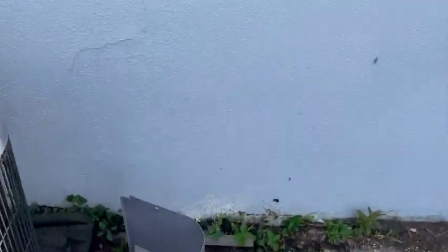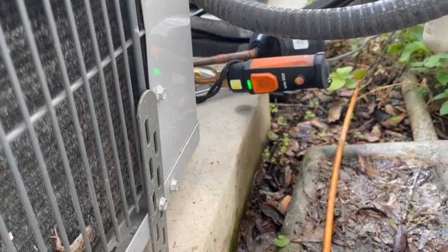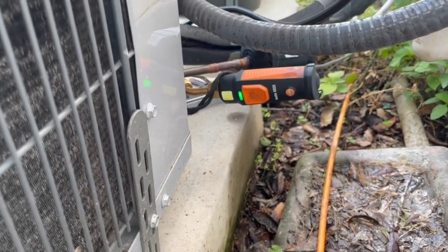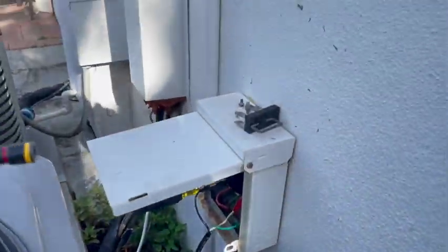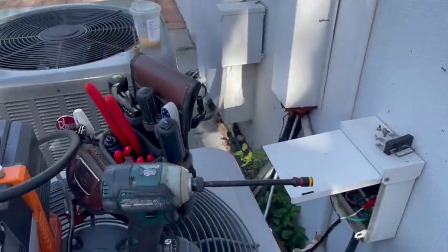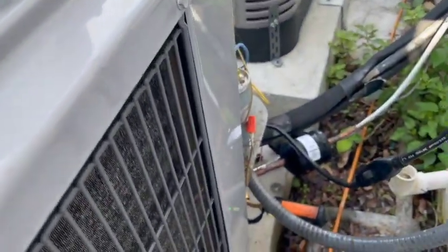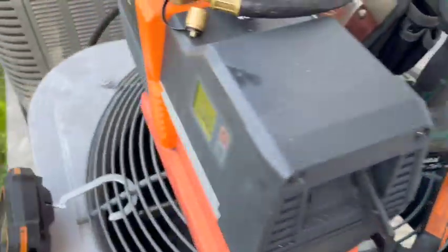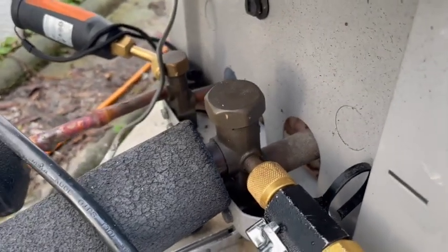I have my Bluetooth vacuum probe, which has been giving me a little bit of problems recently. I don't know if it's that or what's going on. But a couple full system pull-downs with existing coils makes a bit of difference because it's hard to get all the refrigerant out — it takes a while. Then I make caps and reinstall just to make sure I'm not sucking in atmosphere.